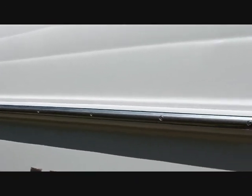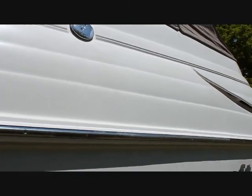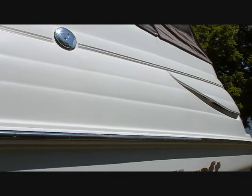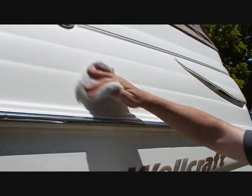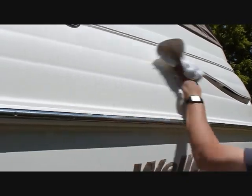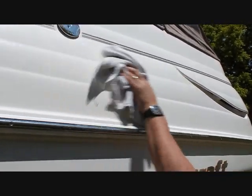We just accomplished what would take by hand a while, and we will now put the water — we are ready for the water. You do the same finish as you would with doing it by hand: that is a damp cloth to put a water sheen to set the acrylic. Then you can either get a dry buffing pad and buff it out, or hand buff it, which is what we are doing now because it is such a small area. But if you were doing this with a buffing machine, you get a dry buff pad — probably need a couple of them — and buff it out.